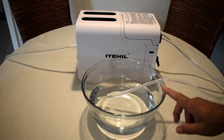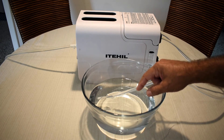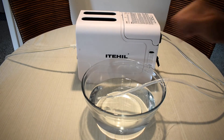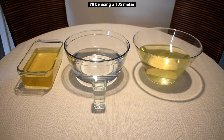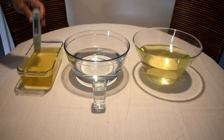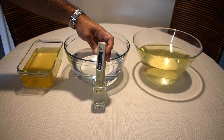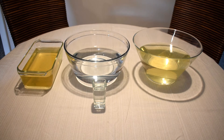Just to prevent my wastewater from overflowing, I shut this off. You can see the water is extremely clear here. What I'd like to do now is take a sample of this purified water, a sample of the wastewater, and a sample of the input water, and compare all three. This is just distilled water here to dip the sensor head in before moving into the next collection area. Let's start with the original again — showing 345 parts per million.